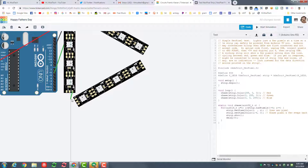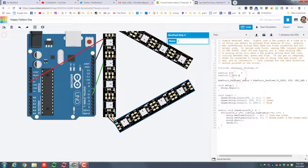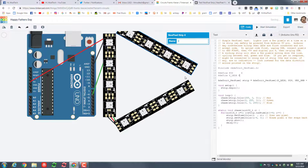I've got my INs and OUTs going in the right order. Let's start by connecting our digital IN — I'll do the little bend where you click once out in space and then connect — that makes it nice and easy. Then 5V connects to 5V; I'll make those red so they show up clearly as the project grows larger. Ground to ground, and make that black to keep things consistent. Back in the code, we now have eight LEDs so let's change the count to 8. Let's hit Play and make sure the first eight light up — so far so good.